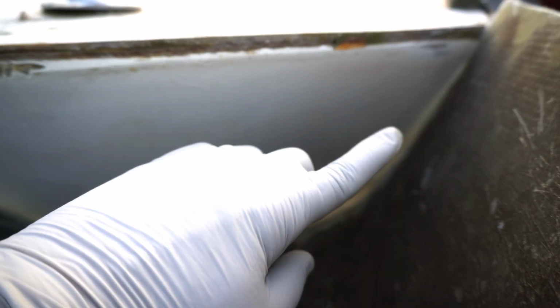Okay, as we move to the inside, you can see there's a really big gap between the boat and the transom. And the only part that's actually hitting is up there by the gunnel. This is why when I made the transom extension in the garage, I did not really worry about getting it perfect up to the boat, because I knew that I would never get it perfect up to the boat. So why try? So I made it close enough, and then we'll bridge the gap and fill it in with a bunch of fiberglass and then tab it and everything else. So it'll become a strong connection and a tight bond from transom extension to transom, but why stress it when we're gonna get here and have the same situation anyway? You get one high spot and everything else is gonna be off. We could either sit here and adjust forever to get those high spots off, or just put in new fiberglass, bridge the gap, and call it a day.